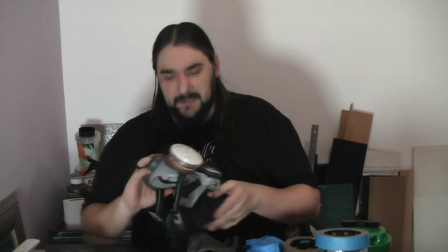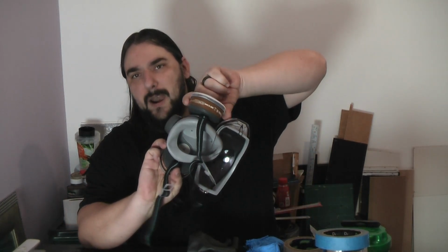Now, this is a cheap little Chinese knockoff one that I managed to get on Wish basically, but I do know my masks, so I know this isn't too bad. You need to make sure that you get at least a brown rated filter. If you go online, you can find the different grades. You've got greens, you've got blues, different ones that will protect you from different chemicals. This, I believe, is organic vapors, which is kind of the minimum you would want to use. Don't cheap out on your filters, get something decent.